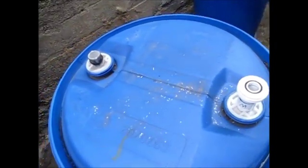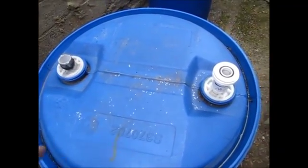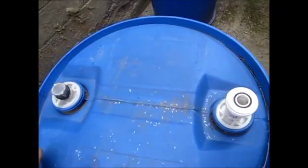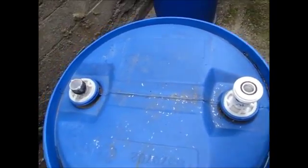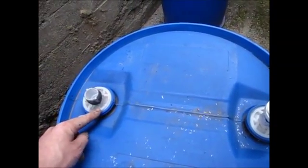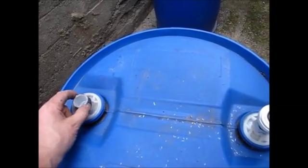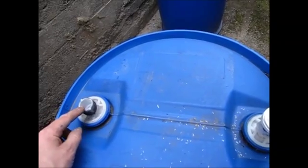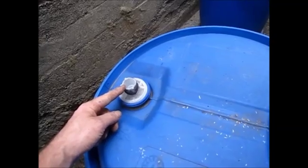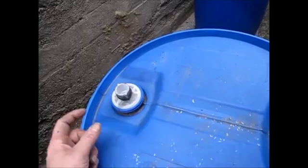Here's what the barrels look like on the bottom — normally they're upside down, and right now I've got them upside down to do the install. Over here we've got the cap with three-quarter inch PVC fitting in it. I've got a screw fitting on either side with some RTV in between, sandwiching it to seal it. This way the integrity of the barrel is complete, and if I ever have a problem with a leak, I know it's associated with the bung.